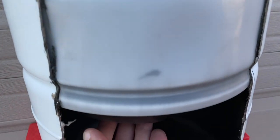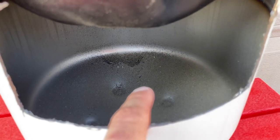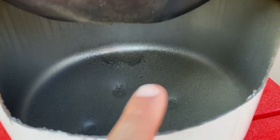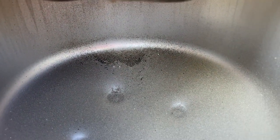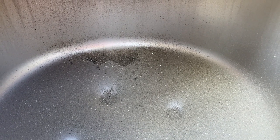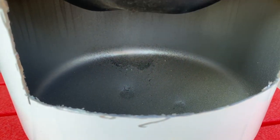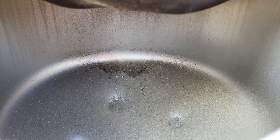What you can run into is — in the event that you do not have enough PSI, say for example it's down to two PSI — you don't have enough pressure or strength to push this heavy bladder full of water up and push that water out of your tank through the lines and out of the faucet. In addition, you could actually have a leak in your bladder, which allows water to flow down into the air portion of the tank. If that happens you need a new tank, because water will fill the air chamber — say two inches on the bottom — and that will definitely interfere with the PSI inside the tank, and your bladder will not be pushed up as it is supposed to be.